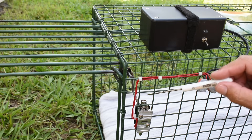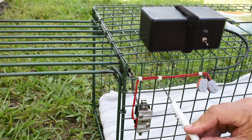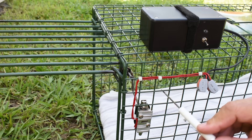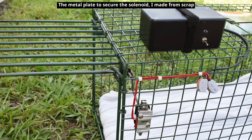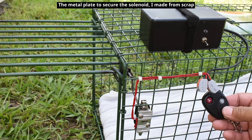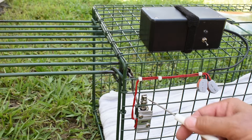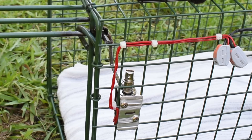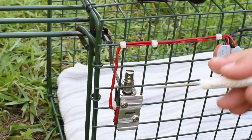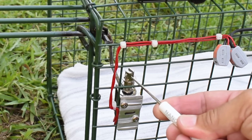The O-ring is just to keep the plunger fully retracted into the coil when you're using the other method of triggering. Right now it's set so that if an animal walks in and steps on the plate, it will lock the door. In order to use the remote control, remove this O-ring — just slide it off the bottom. With the O-ring removed, the plunger is now free to work. The problem I've noticed with these solenoids is that there's excessive play in the bore.